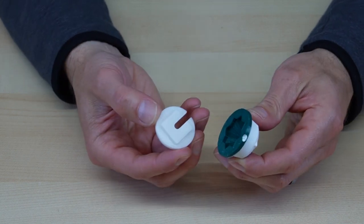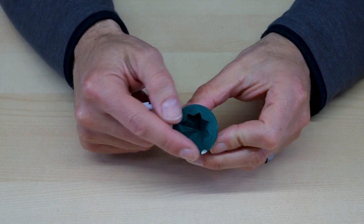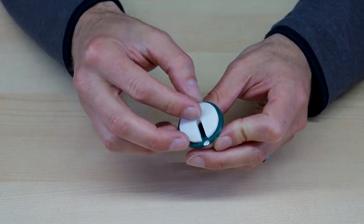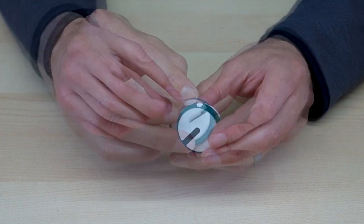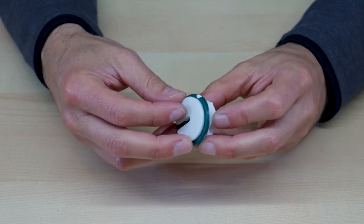The best part of this design is that the combination is completely customizable. I designed the knob as two pieces. The base piece has a square post on it, and the upper knob has an eight-sided star recess in it, so the base can be attached in any one of eight positions. This small notch on the back of the knob matches up with the arrow on the front, so my niece can see which way the arrow points while she decides which combination she wants.